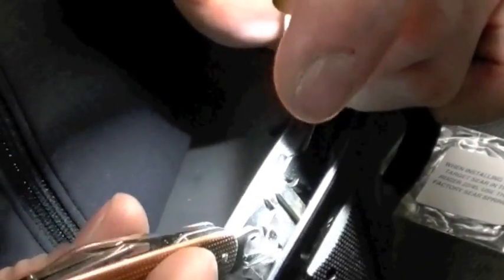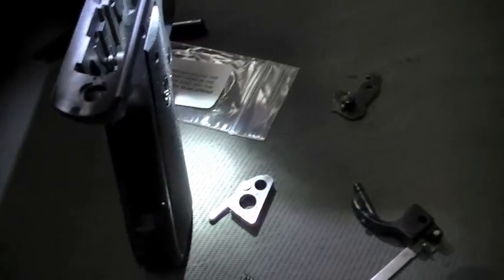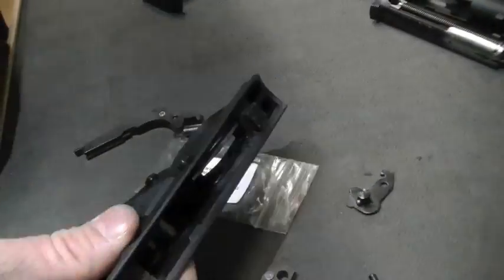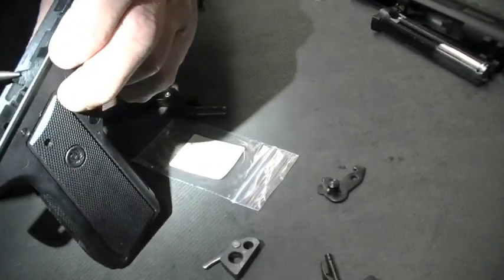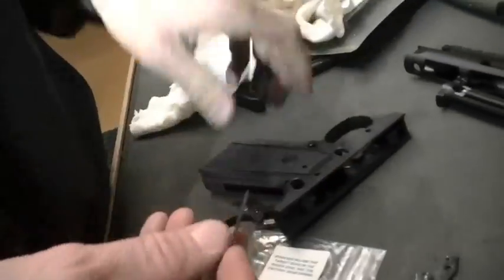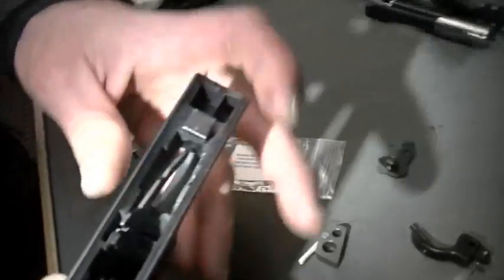I've got to make sure that sear spring is on that notch — see that? There's the notch, there's the sear spring. That's correct. When we tension the sear spring there should be resistance toward the forward part — I believe that's correctly installed. While we're here, we're going to take the detent out of the bolt release. That way it will drop all by itself. This is your bolt release — just wiggle it out, and there goes the detent. So that's gone and now it's back — the bolt release is installed without the detent pin.